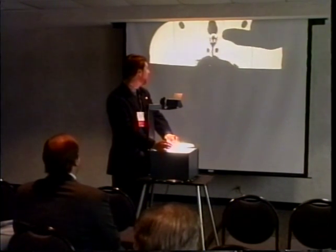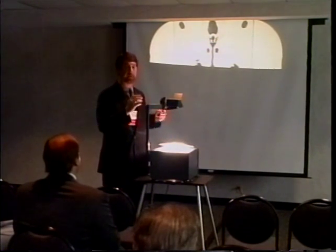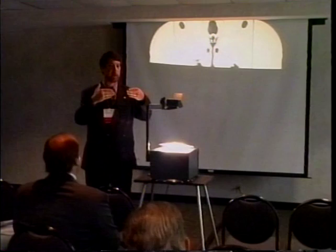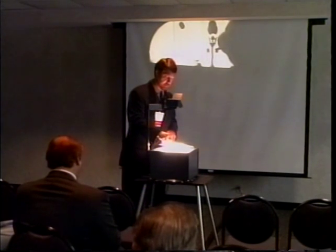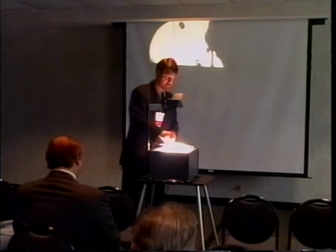If it's not, then you want to open your banking pins, whichever banking pin you need to open. Well, if you open one, you want to open the other one the same amount because you're starting from the center position, okay? So we have our banking pins adjusted. I'm going to back them off just a little bit just because I've used this model enough. I know that I'm going to need to.